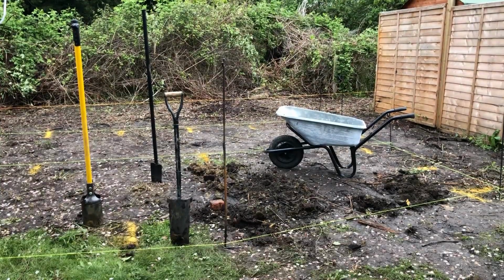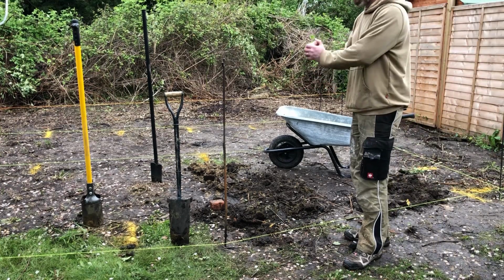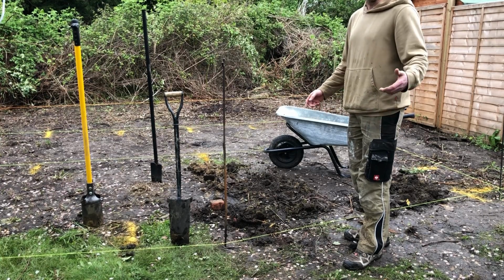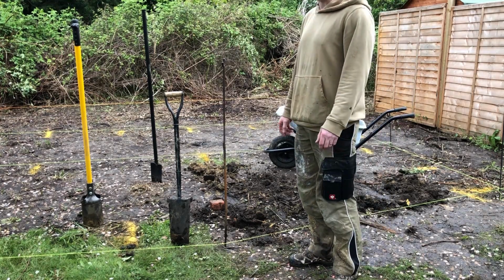So, yeah. A bit of water in there won't hurt anybody. Slot my concrete in, put the rod in, wiggle it around, top it up, done. That won't stop it drying. You put concrete into the ocean or a river or whatever, a bag of it, it's still going to go off. You can't stop that chemical reaction. So yeah, if you tried, you couldn't.